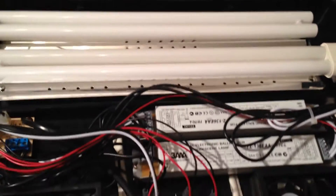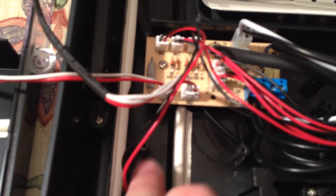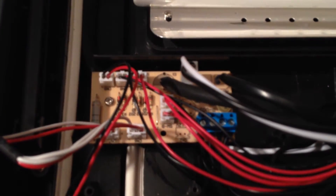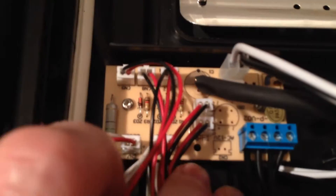It was a constant buzz from the cabinet, reverberating around the plastic. So before I started doing any sort of modifications to turn the lights on and off on different timers, I thought I'd take care of that and get it out of there. The transformer sits in there and is screwed down to the top of the lid. You can see the mains in red and the blue going off to the circuit board, giving it nine volts AC.